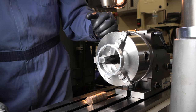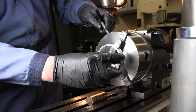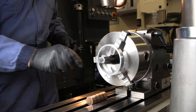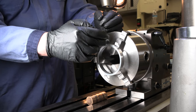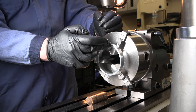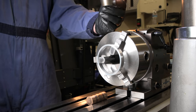So first off, we just need to make sure that we have this nice and centered up on here, and then also get our halfway depth back. So to do that, let's get this clamped in our chuck. Again, we've got a nice flat surface to hold that against. Don't need to go crazy tight on it. It's not really gonna go anywhere. You could use an edge finder. I'm gonna use a Haimer because I know that that's nice and centered up, and I'm gonna actually move that back and forth to find the high spot on that arc, and that's how I'm gonna center it up this way. And then while it's in there, I can use that on the edge, find my edge, and then come over half the width of our part. So we're 562 is the width we ended up with, so 281 will get me halfway across.